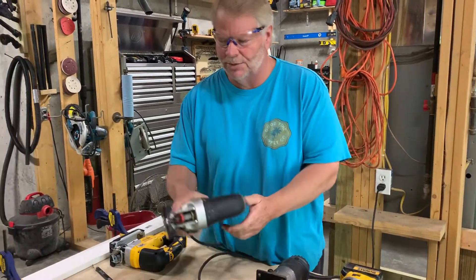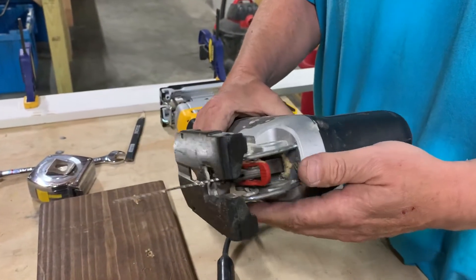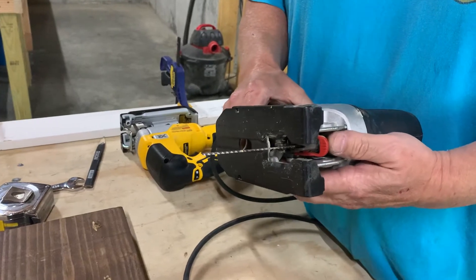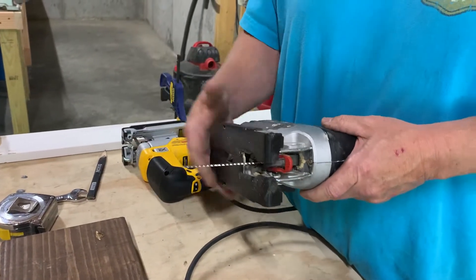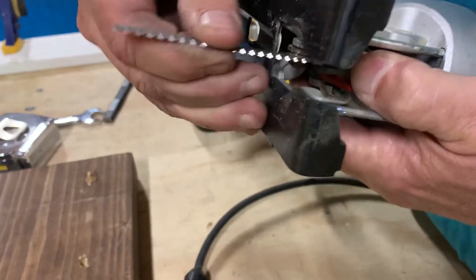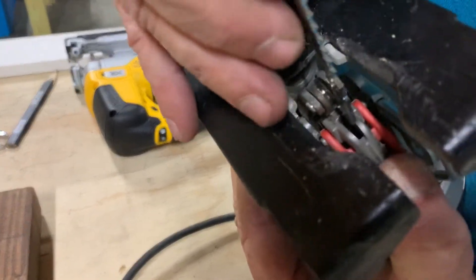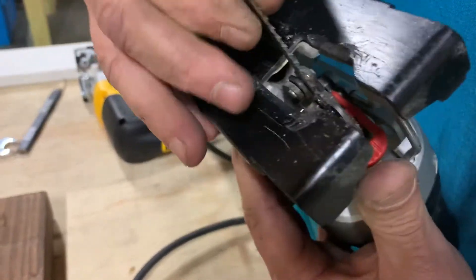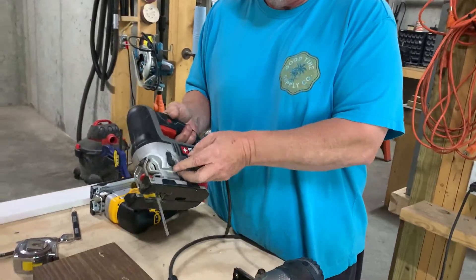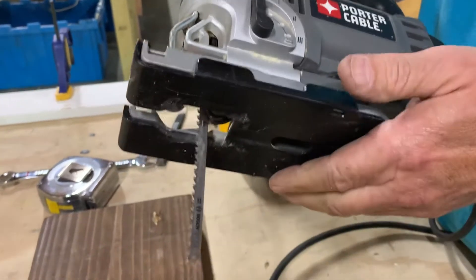Let me just go through this real quick with you. They work pretty much the same on both tools, whether it's battery operated or corded. To put the blade in, first of all, always make sure it's unplugged. You want to always keep safety in mind first. Notice also I'm not wearing gloves — you don't want to wear gloves when you're dealing with power tools. On this particular one, you've got a little lever right here. You just push that down and the blade comes in and out. The blade slides in there and locks in place. There's a little roller pin there that it secures against, and the blade is good and solid and ready to go. This little side right here basically tells you how much pressure to put on that blade, and we're going to put maximum pressure on it, leaning it forward.